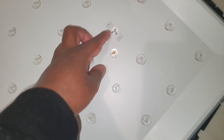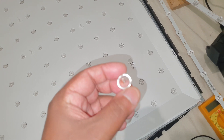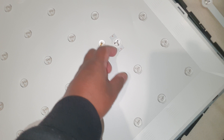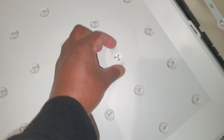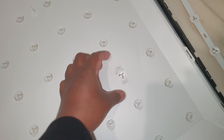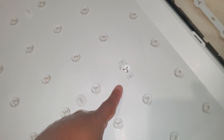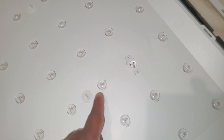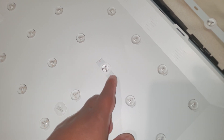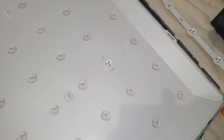What you can do is remove the original lens — not the LED — and paste it on the replacement. But in this TV we can't do that because the original lens is burned. If you use this burned lens, you'll still see a dark area or white spot on the panel. So I'm going to use the different lens and show you a trick to avoid that white area on screen.